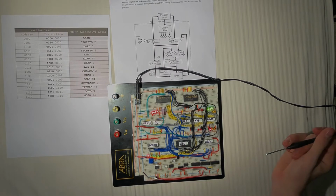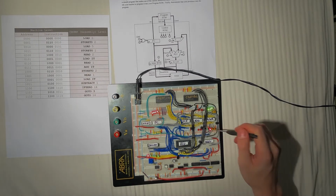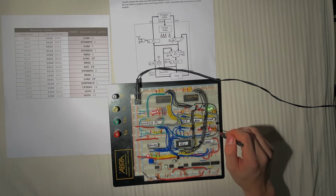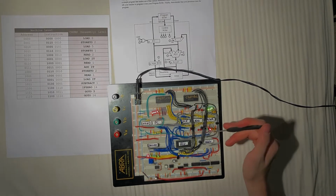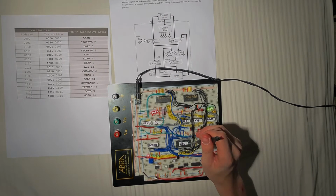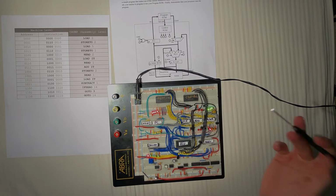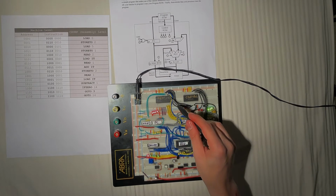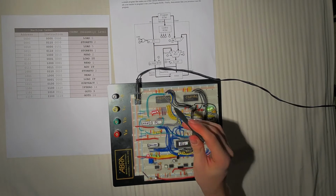Important connections to note are 10K pull-up resistors on all the RAM outputs, because the RAM outputs are open collector, so you need to add 1K or more pull-up resistors. I chose 10K. As well as the ALU A equals B pin is a 2.2K ohm pull-up resistor.